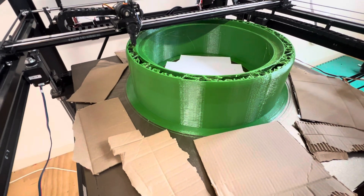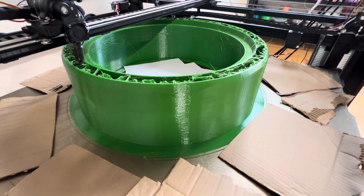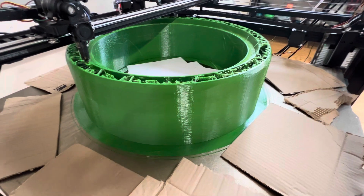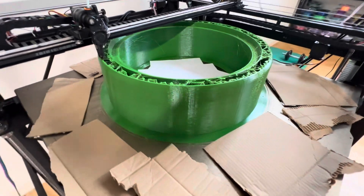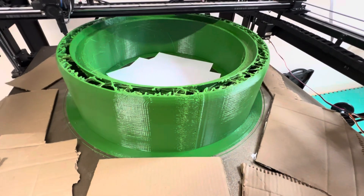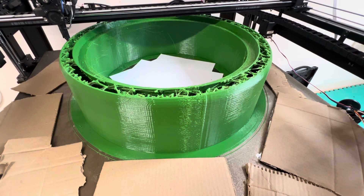I've played with my belts and tightened them up, and I'm very happy with most of the 360 degrees of walls. PETG is heck of a shiny so you can see a bit of a moiré pattern there, particularly on the X-axis as it gets around.